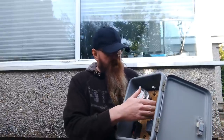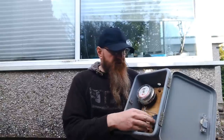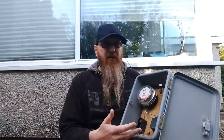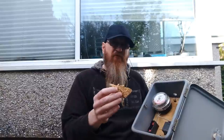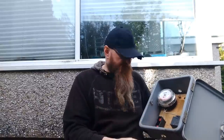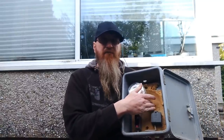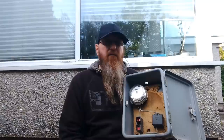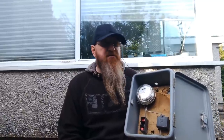The backing in the box is just a piece of wood, as is often the case, because it's the most versatile thing — you can just screw as much stuff as you want onto it anywhere. In this case it's a rather crumbly chipboard which has succumbed to moisture over time. There's been something else in here which I'm guessing from the outline was probably a mercury vapour ballast, since metal halide usually requires starter gear as well.